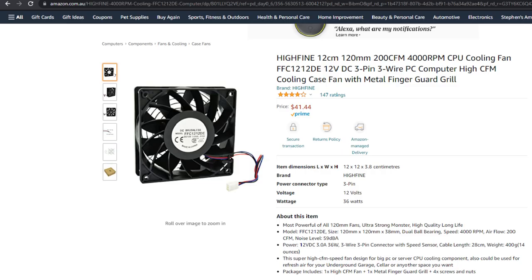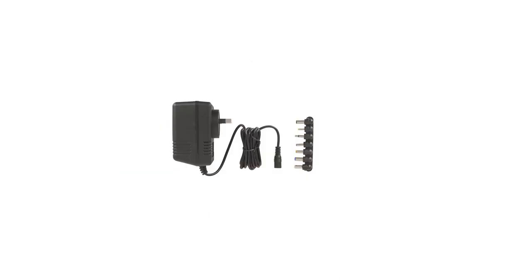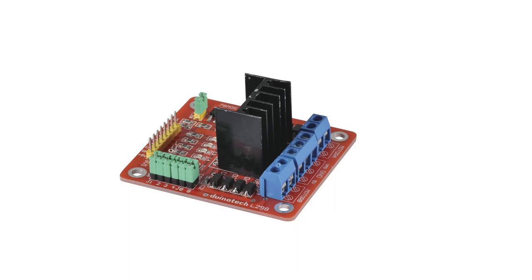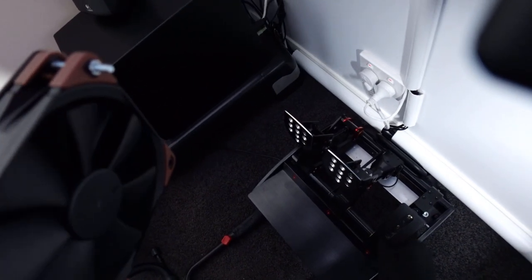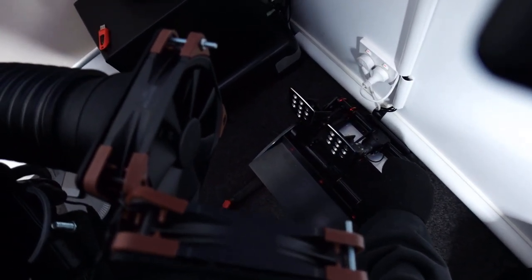There are a few ways you can control and power the fans, and most online guides suggest getting a pair of high powered, high flow server grade fans. This however requires a DC motor controller board capable of high power output and a power adapter capable of powering both the board and the fans. This can add additional cost and components required, and in my testing with an L298N controller board, didn't give very accurate RPM control. So in the end, I found the best solution was paying a little extra for some Noctua high flow pulse width modulation fans.